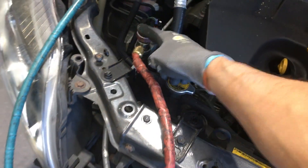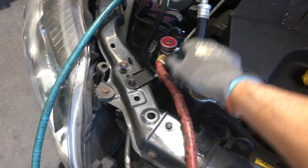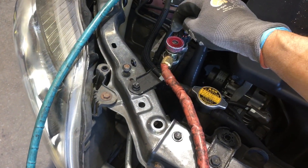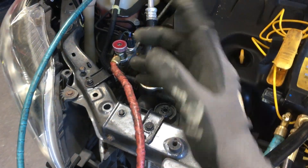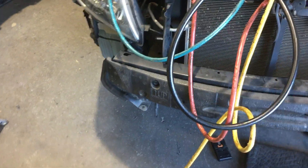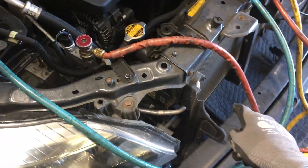All your oil is in this liquid, coming right off the high side circuit. This is why you do not want to recover from your liquid line first, because you would be getting a solid column of liquid — which is a faster way of removing refrigerant, but in automotive it's also a faster way of removing lubricant along with that refrigerant.